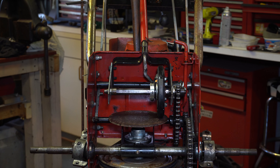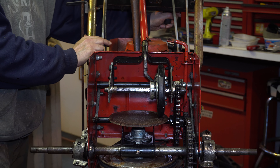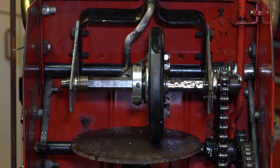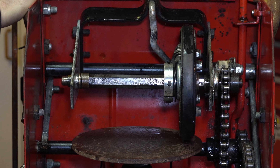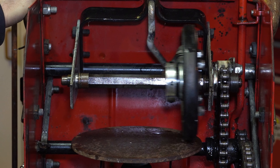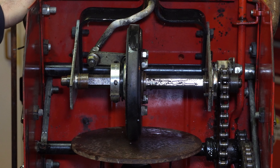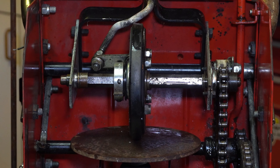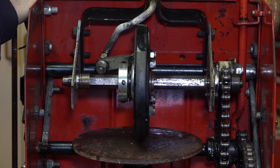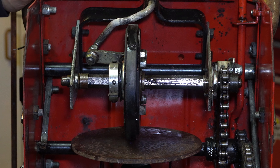Now what I did—I'll show you in the other camera—this linkage here I tightened up, because there are spring washers on it. I tried taking this piece off and you're not getting it off, so this is the solution. I tightened this up so we don't have all that slop. It could probably be a little bit better—it bent a little bit more—but over time, third gear is pretty much the gear you're going to be in. It's going in good, and everything is moving now. There's a little bit of junk right over there, so we're going to clean that up. I want to pull this nut back off and put some blue Loctite on it because it's a little loose—they have these sort of lock-style nuts with a crimp in them, but I think just a little blue Loctite. This one's binding up a little, so that's why they need to be a little loose. They have to have a little slop in them—that's why they put a spring washer in—and this piece pivots.